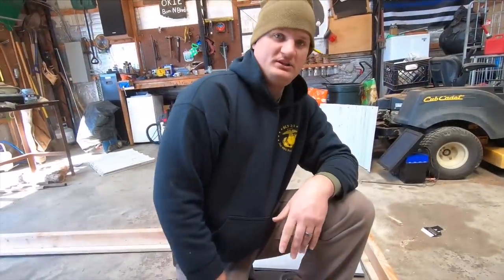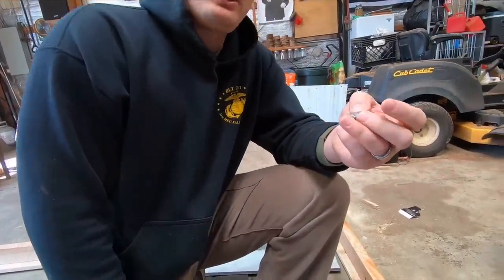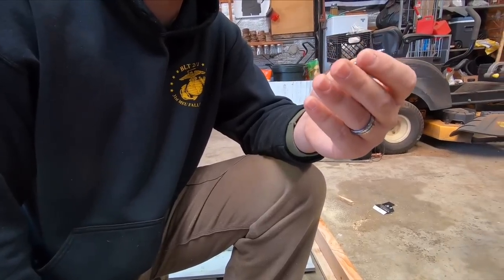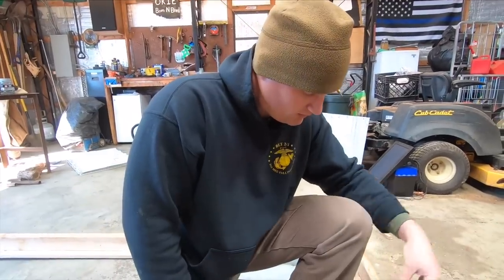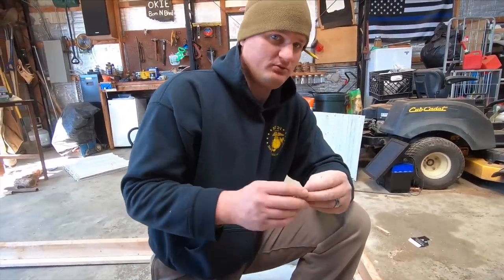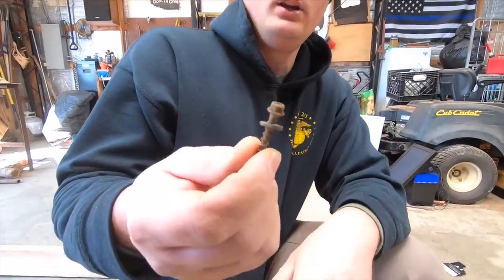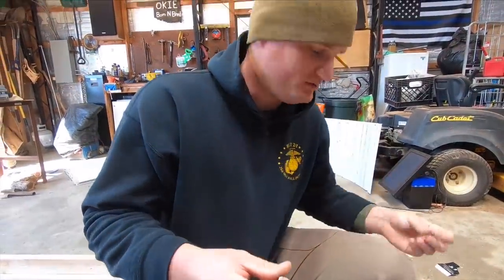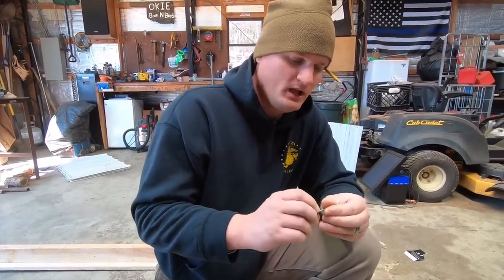So we are now putting the tin on, and what you're going to need is just some regular roofing screws, just because they're easier. You're going into metal and then going into wood, and that's what these are meant for. You don't have to be perfect. I got some old rusted ones that I found on the ground, and I'm going to use those. I don't have a lot of them, but do with what you got.